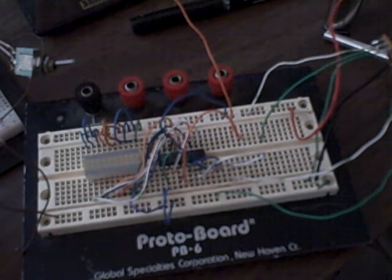So as you can see it works. That's pretty much the exact same circuit that I drew and sent. It's just that the wire that used to go to the pot from the voltage divider is now hanging off the output of the 386 amp.